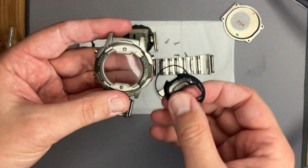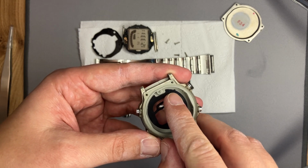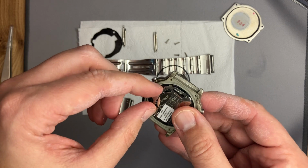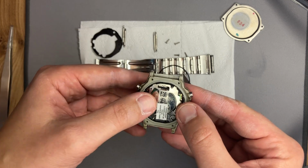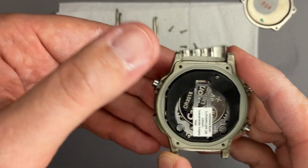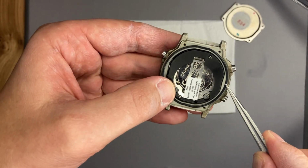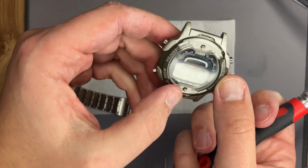First, what we will do is identify the position of the inner display. It's great. Here it's a rib, so it's a Poka-yoke system. Then let's take the module and sink it in. Very easy to do this. Good. Now it's perfect. This pusher was slightly hitting the plate, and now let's put the next part, you cannot miss it, so it's a one-way position. Now let's try to squeeze in the gasket again, and let's put the back plate. This is done.